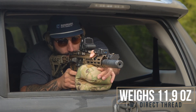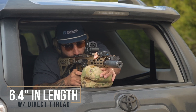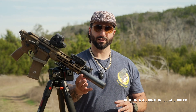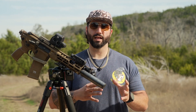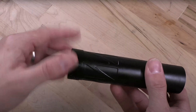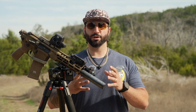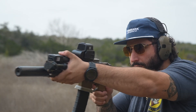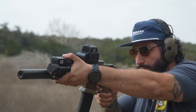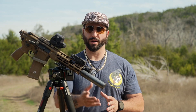The Peak 30 comes in at a featherweight 11.9 ounces with a direct thread adapter. It measures 6.4 inches in length with the direct thread adapter, and the maximum diameter is 1.5 inches at the serial ID ring. This can features our serial ID ring, like all of our centerfire suppressors. This makes warranty claims and repairs extremely easy — if you have a damaged item, you send it back, we drill out the swage point, unthread the serial ID ring from the core, thread it onto a new core, re-swage it, and ship it back, essentially getting you a completely new suppressor minus the serial ID ring. The front cap and direct thread adapter are made from 17-4 H1150 stainless steel of US origin. It ships with a 5/8x24 standard direct thread adapter for a 30-cal suppressor.